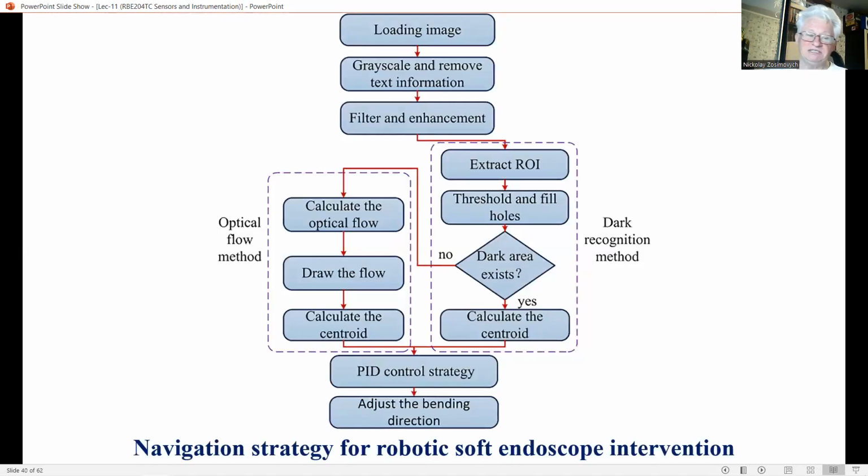Movement is change in position, and hence it can be measured by any position sensor, provided such sensor has an adequate range and response time. When the movement is beyond the range of a position sensor, for instance, as may occur with moving robots and AGVs, other sensing techniques to capture the position are required. A simple optical navigation method is tracking a marked path.